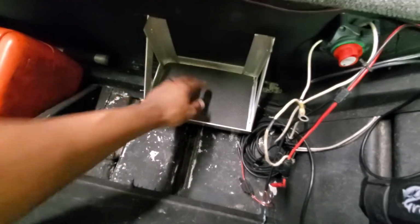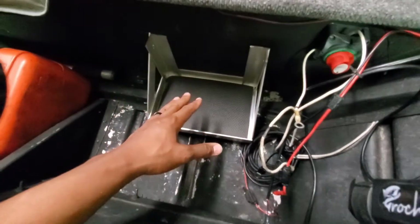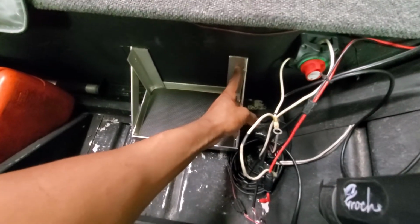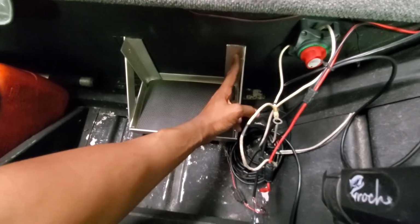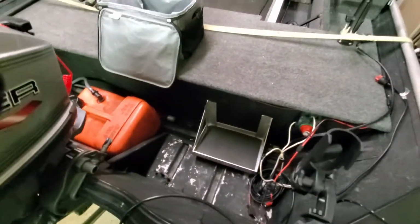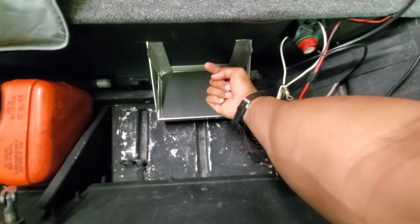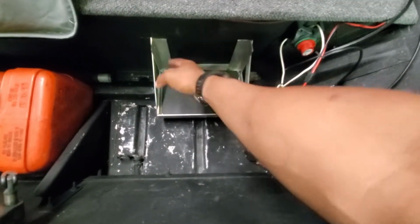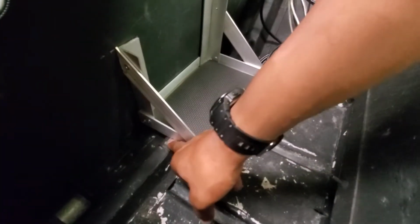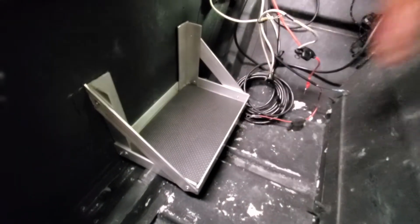So now I've got my bottom support with the existing brace, bracket, framing, whatever you want to call it. The only thing I'm going to do next is add some supporting rivets, probably two here, two here. I'm going to pilot hole and rivet those in, and I think that'd be it. Like I said, I'll put the battery strap through first before I do that final securing right there. I think that's going to work just fine. I've got good bottom support, and I'm going to have support back here to keep this thing from teetering forward.